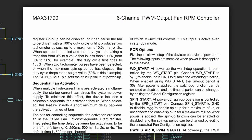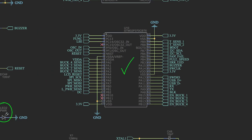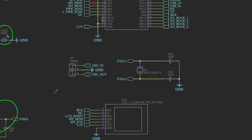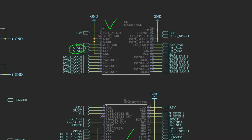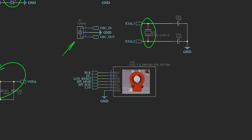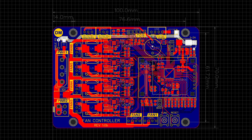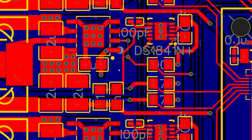Write in the comments — if there are a notable number of such comments, I'll make a review. As for the MCU, only three pins are unused; everything else is utilized, to get the most out of it. There's a 12MHz crystal with built-in capacitors, and a standard 32.768kHz watch crystal for accurate RPM measurement, connected to the MAX-31790, which then clocks the MCU's LSE — I'm not using that yet but it was proper to include. The display module is from AliExpress, a fairly popular model. The 4-layer board also helps dissipate heat from the converters; since the inductors are powerful but don't heat much, the thermal performance is effective.